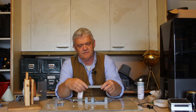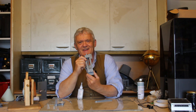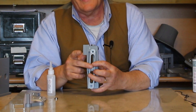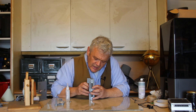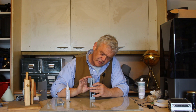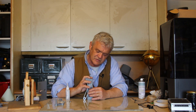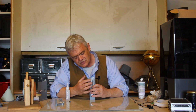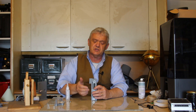Take the other slide guide half and pop it onto that structure. Once assembled, you're able to raise and lower that pivot point by twisting the nut, which brings the carrier up or pushes it down. If the pivot is in the centre and you move the bar backwards and forwards, you get the same range of movement at both ends. But if you move the pivot up, the same input movement produces a much larger range of motion on the output side.